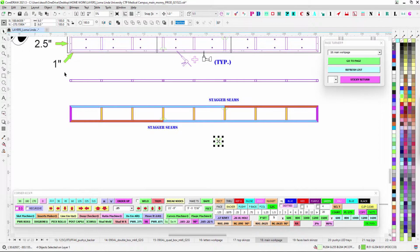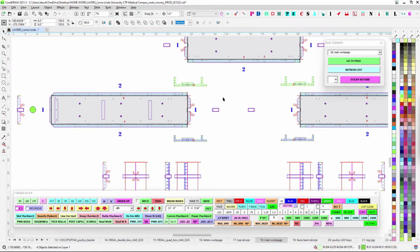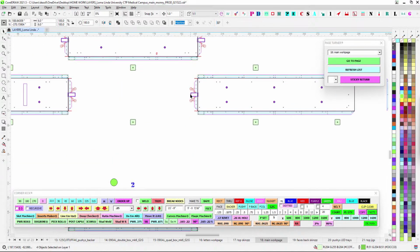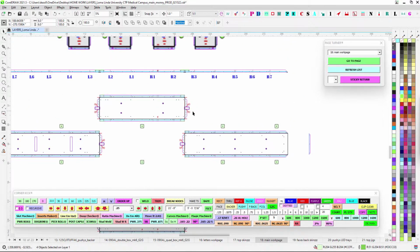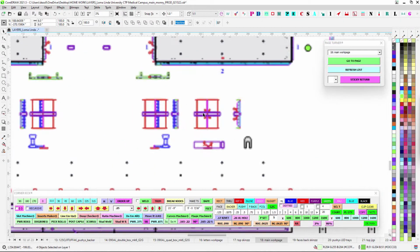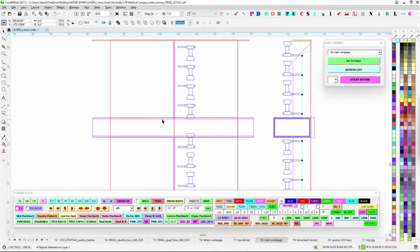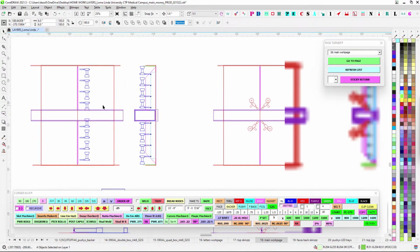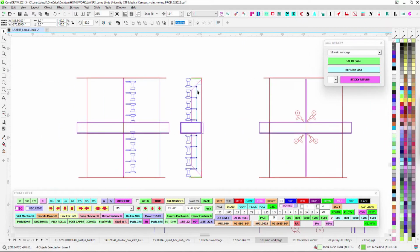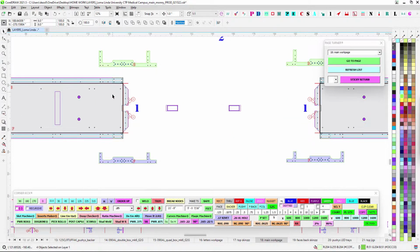Once you have this welded as one piece, you'll take the 3 bottom pieces here and bend up these flanges. I'm trying a new quick no-lords version of that for you guys to see how that works. When you bring these 3 together, let's look at how that looks right here. If you're looking at a top view, you're going to bonk these 2 flanges together, and then the 2x4 is going to slide right in between there. That gives you the ability to weld this flange to the 2x4 from the top, but also to just rivet right across, and that's going to bring these 3 together without having to do that patch thing with the lords.